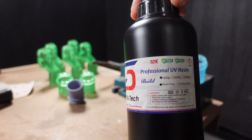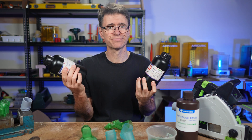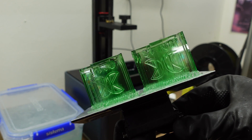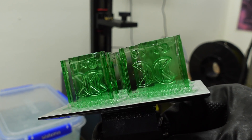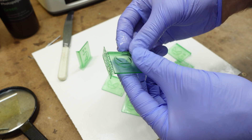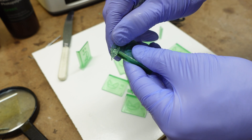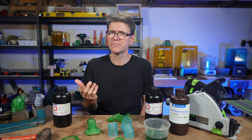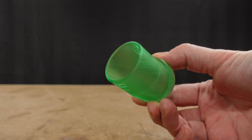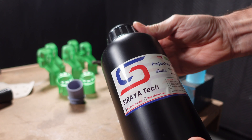It's only when I mix the blue with the Anycubic Tough that things really improved. So I can see this as being a useful resin to mix with other resins to find the exact properties you're looking for. And to be fair, Soraya Tech makes that comment on their website about another one of their resins called Build, which is also good for functional parts especially when mixed with blue. Here's an example of fortifying another resin: this part is made with Elegoo water washable resin mixed with 50% Soraya Tech Blue. On its own the Elegoo is brittle and not really what I'm after, although I do like the colour. After mixing it with blue the result was very good, though somewhat unpredictable because I'm mixing a water washable resin with a non-water washable resin. You can see that the print is still quite brittle when removing the supports, but it's a big improvement.